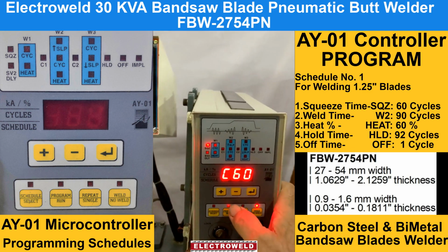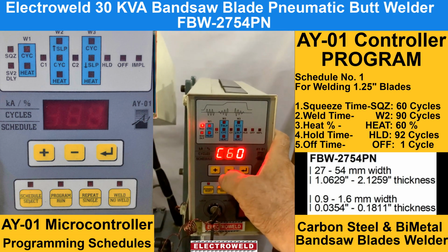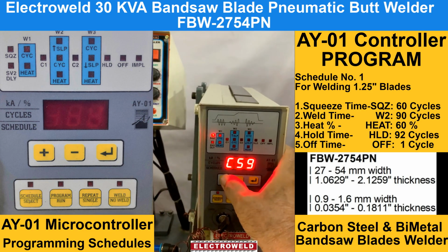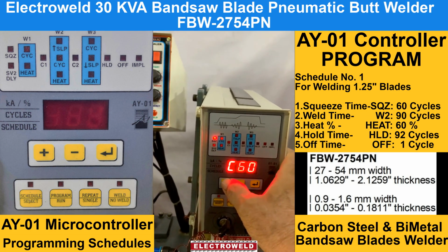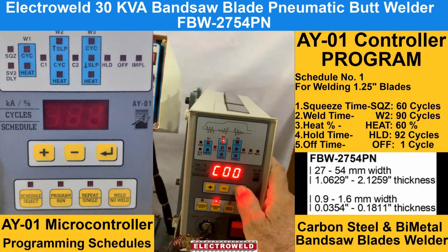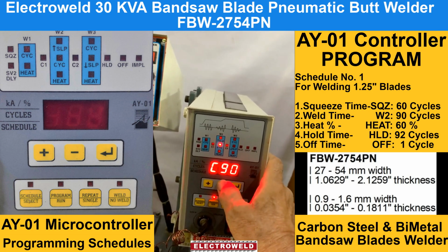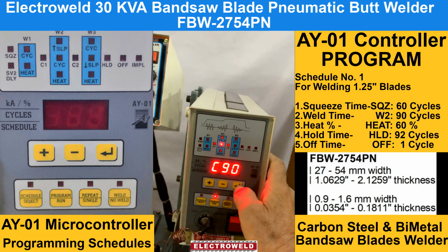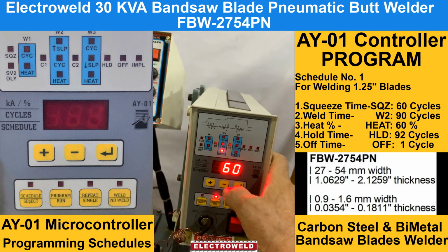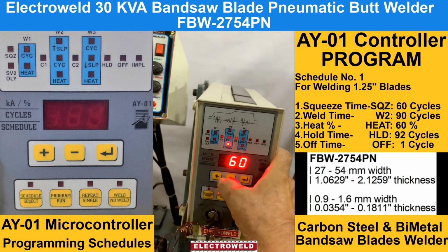For welding 1.25 inch blades, we have selected squeeze time 60 cycles, that you can reduce or increase depending upon your requirements. Then you can press the button until you come to W2. This is weld cycles, we kept 90 cycles. This also can be reduced or increased. This here is the heat percentage. This we have set for 1.25 inch bimetal blades. Same also can be decreased or increased.